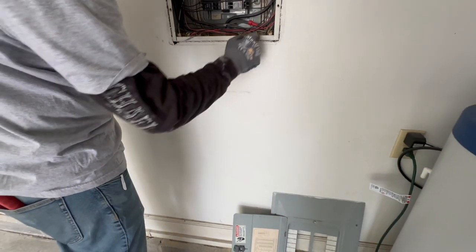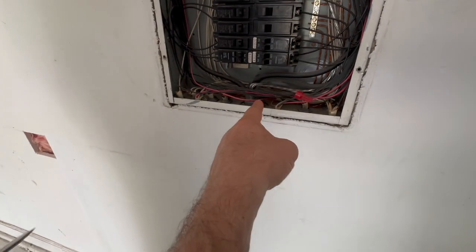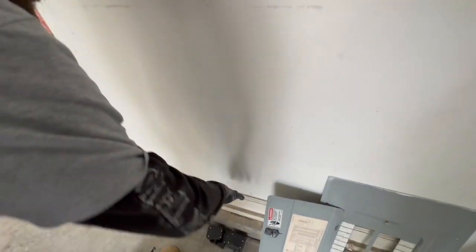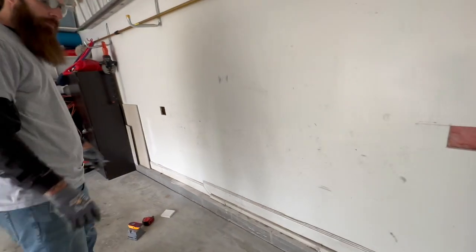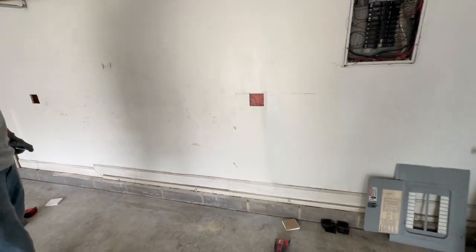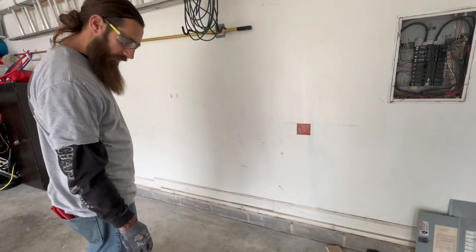Put the box on this side, but the hole on this side since there are fewer wires coming down. So you're going to be bringing the wires from here down to the crawl space, and we'll come back up to the correct location. At that point we'll put in two gang boxes, the 14-50 receptacle, and a cover plate.